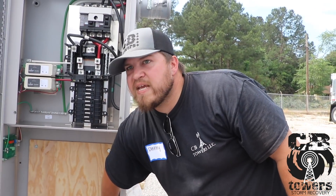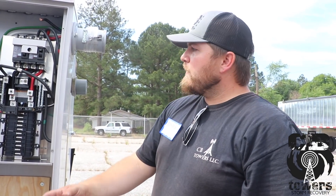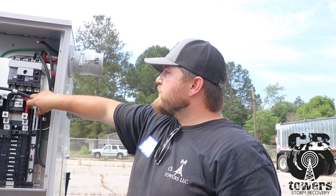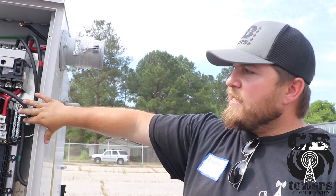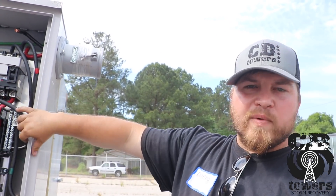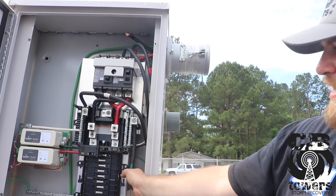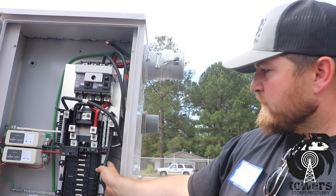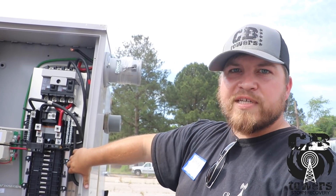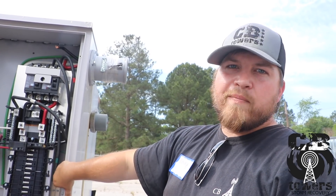For some reason if you don't have those pigtails, strip the insulation off the bare wire and run it up and do the same steps. If you failed to go through the checklist, it might be set up for three phase over there. You come and hook it up, and because you didn't check it, somebody might have stolen a wire to use for the third leg — say they stole your green wire and you didn't pay attention. It's hooked up to the hot, so when you power it up, you're going to blow it up. You can hurt yourself, maybe kill yourself, and you'll damage all the equipment and burn the generator up.